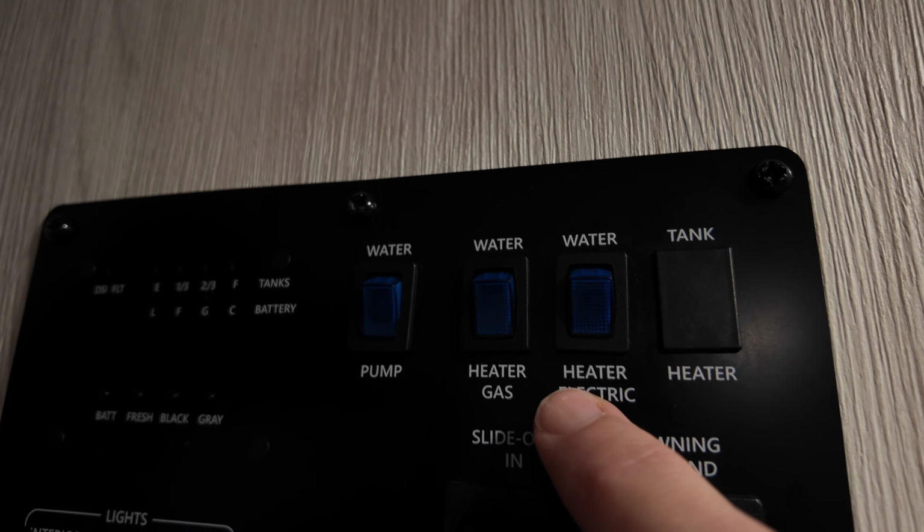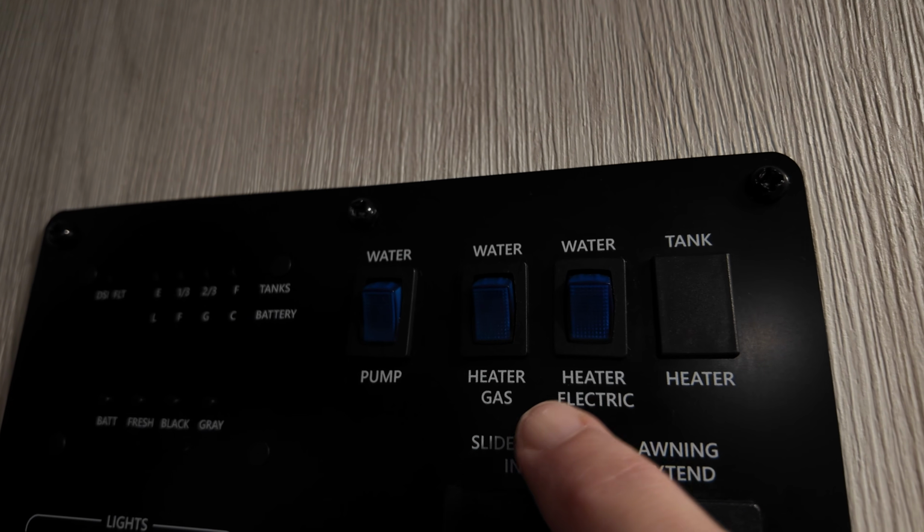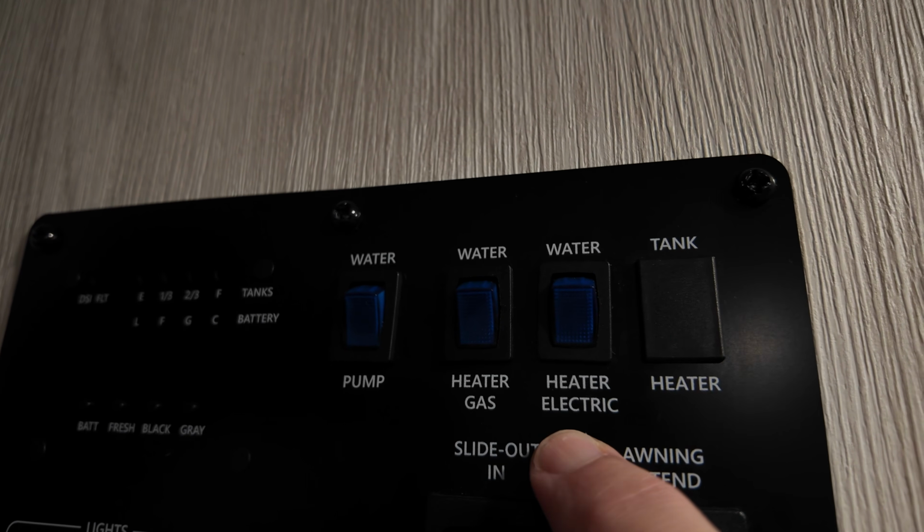I have read online that you can do a water vinegar mix, and then turn on the water heater for several hours and then rinse that out. But I've also read that people just rinsing out the tank and changing the rod was enough, so I'm going to try that first. I have a video on how to empty the hot water heater already, but I just want to remind you that you should never empty it when it's hot. So make sure it's off and make sure it's cooled down.